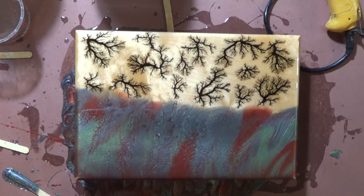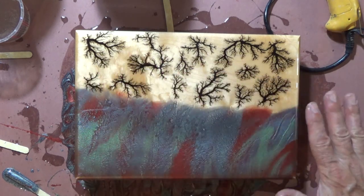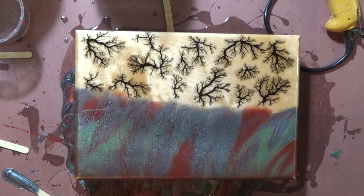come off video because this is going to take a while. That's the thing with any of this epoxy resin pours, you got to let them sit for a little while and bubbles will keep producing, and you just got to stay on top of them until it gets to that point where they quit popping up. There's still a few bubbles popping up over on this side, but from this clear side, it came out perfect. Where this is a little bit thicker, I still got a few bubbles, so I'll keep hitting those with a heat gun and with a torch until it gets set. We'll come back and take one more look at it.